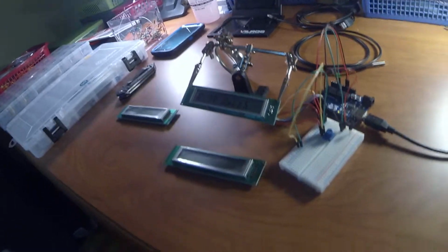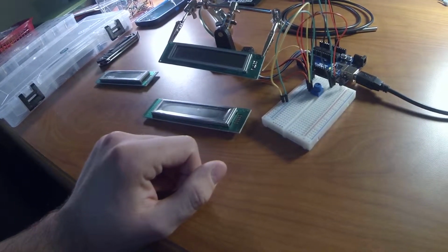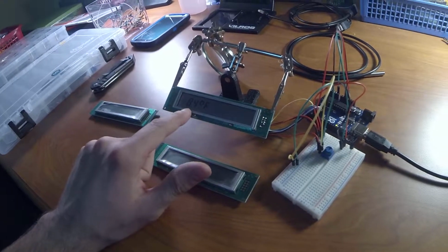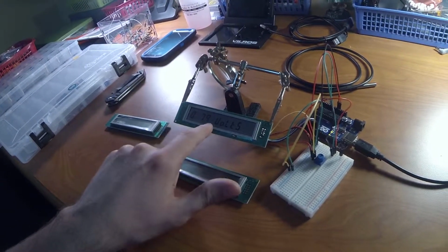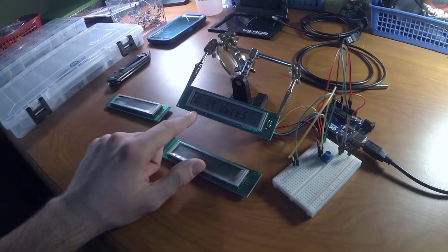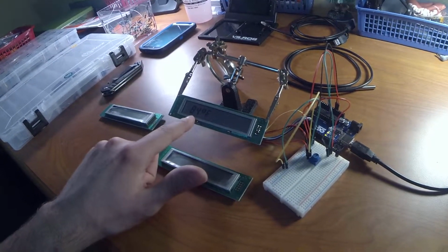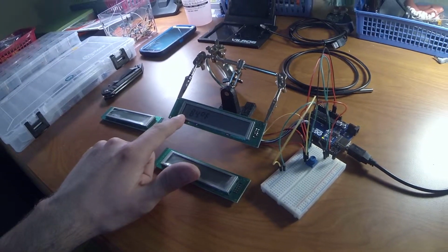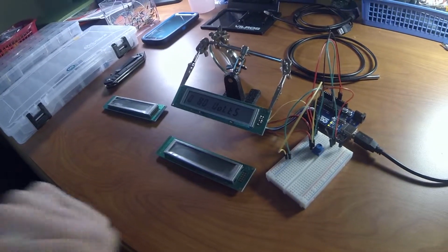So it's really, really cheap, and there's a tutorial online, and I can post it in the description for this video. The guy has written a library that you can import and get it to start outputting information. Right now I just got it showing temperature for this temperature sensor, and then the voltage associated with that temperature sensor as well. I'm still working on getting the decimal place to show, but it's supposed to be 0.79 volts. It's just doing a space instead of the dot. But anyways, that's not really a big deal.